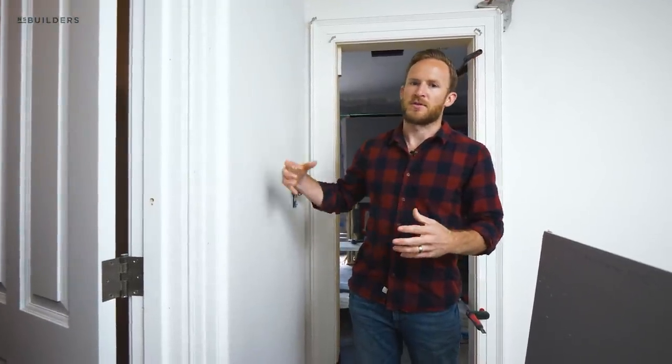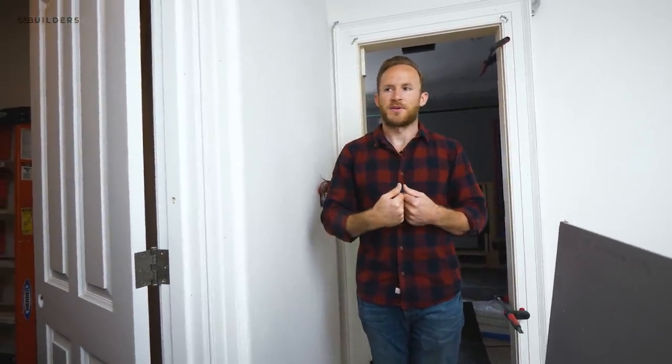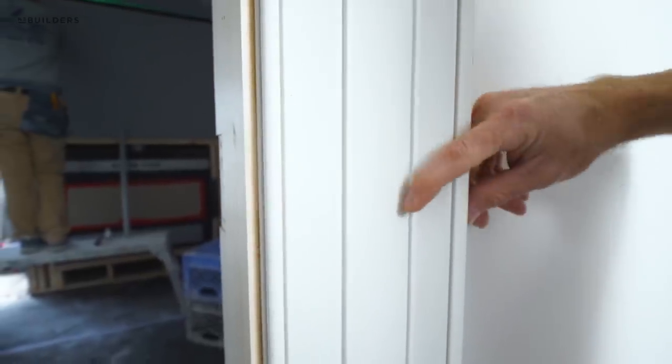We're over in Salty now. Last time we talked a lot about plaster - after plaster we always prime our walls to lock in any moisture that could escape and get into our moldings. We're dealing with pre-primed moldings, but in the rare case the backside doesn't have primer or we're dealing with raw poplar, we don't want that moisture making its way in because over time it creates grain raise that will transpose through the paint finish. We always get our painters in for a fresh coat of primer on the entire place once the pH level hits a desired level. Now we're into trim - the plasters are on site working on prep for our lime plaster fireplace as well as some final millwork details.